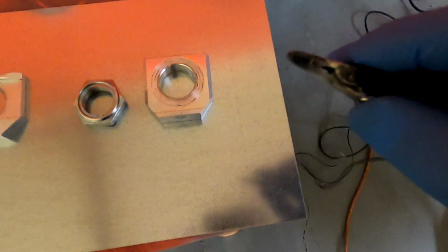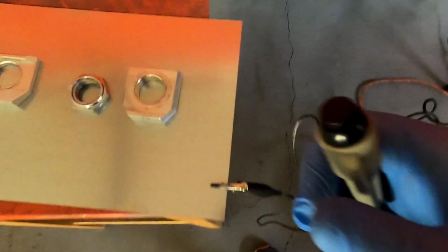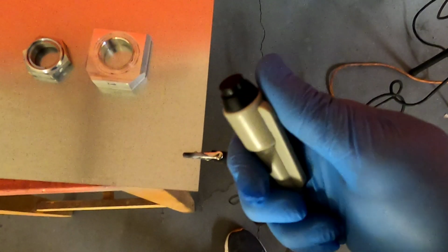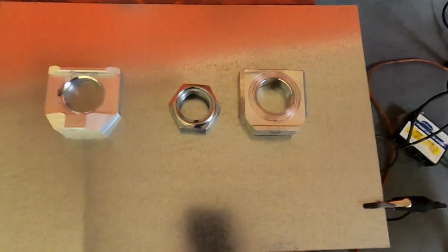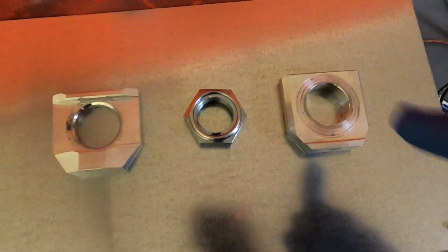I know I have not gone into a lot of details about powder coating, but some of the components are, this is a negative charge. This is the metal portion, and I'm going to put this in here, and I'm just going to get the cable. Whenever you want the spray to stick to the part, you're going to be pressing this button, which is going to complete the circuit, meaning positive charge and negative charge, and that's going to electrify this part, and that's what makes the powder actually stick to the part.